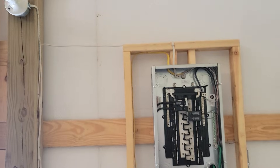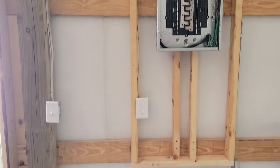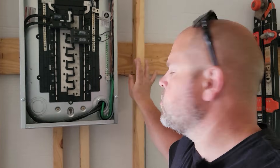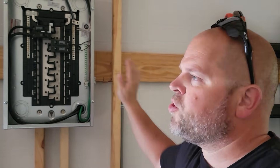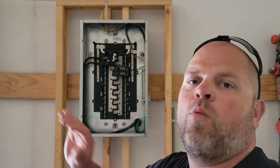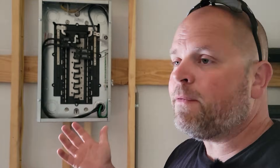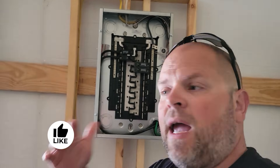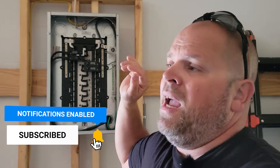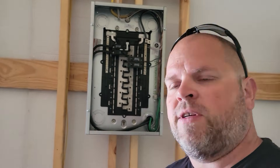Being that we're working in an agriculture building, can you point out what I've done wrong? I did make one mistake even if I wasn't installing in this agriculture structure - my ground is 8 gauge and that's got to be 6. That could be stranded or solid. I was also told I had to have two grounding rods even on a separate structure. I thought that was only for the main structure. Not a big deal - about 18 bucks and the wire I have to buy over.